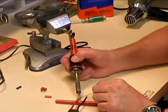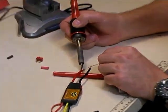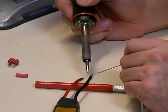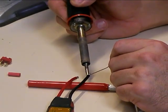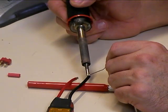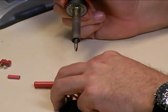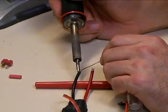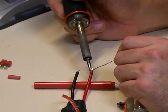We're going to come in here, heat up the wire, and apply the solder. The idea is to fill in all the voids and all the space in between each individual strand of wire with solder so you have good conductivity throughout the whole wire. Once you get it filled in nicely, flip it over and check the other side, because a lot of times the solder doesn't go all the way to the top. You can put a little extra solder up there near the top to make sure you've got a good connection all the way across that wire.